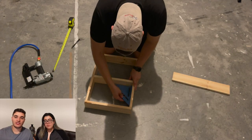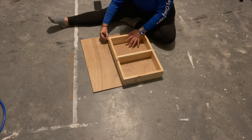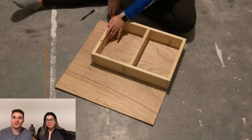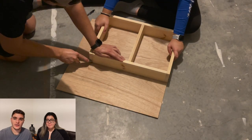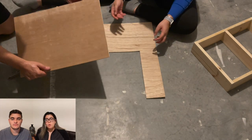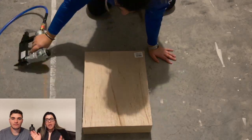You want to make sure to check for squaring every time you are connecting two adjoining pieces. Once the frame was built, we laid it on the plywood and cut it using a utility knife. Our plywood was very thin, but you can use a saw if you prefer. Once the plywood was cut, we picked the nicest side of our frame, used the ugly one toward the back, and we nailed the plywood there.